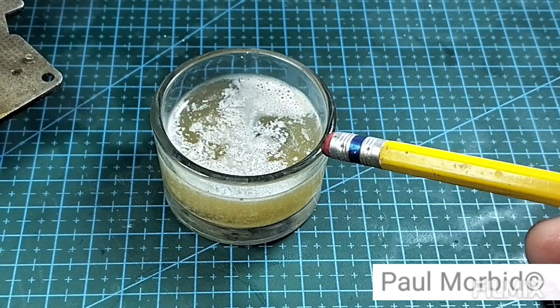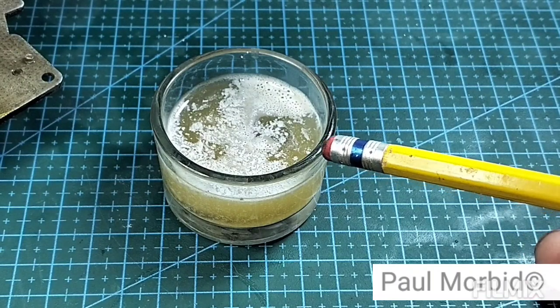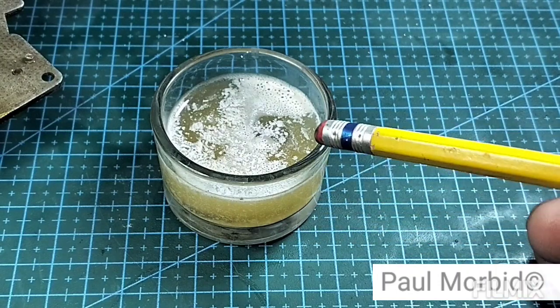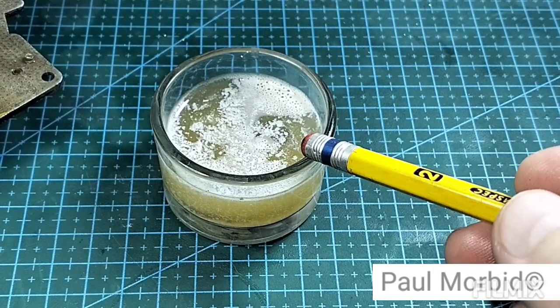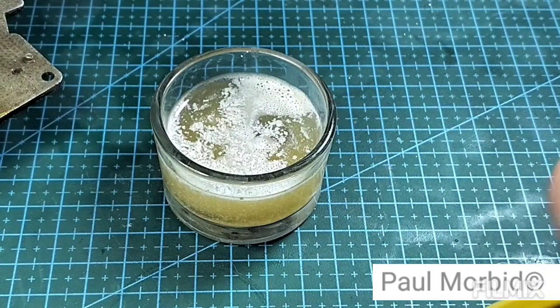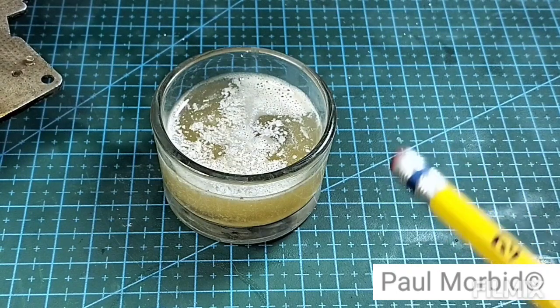So this I want to show you. This has been sitting for several hours. Tomorrow morning will be one day, 24 hours there. So look how dirty that is, okay? So you get the idea why when you first get a Bolex in, you need to send it out to a service technician for a CLA, clean, lube, and adjustment, before filming. That's why. Especially in colder months, those old lubricants will lock up your camera. You know, gotta make sure you got that done.